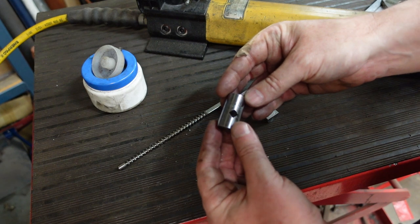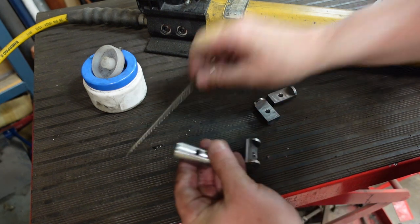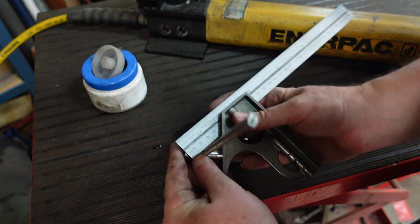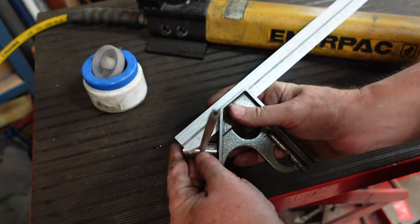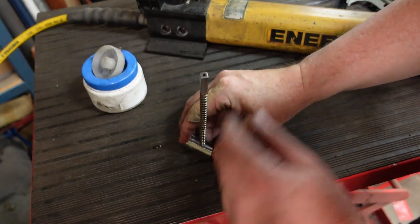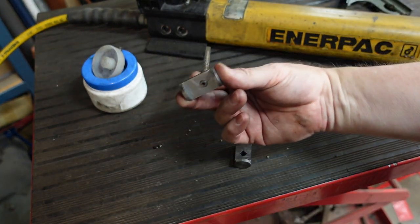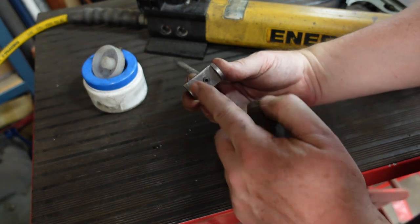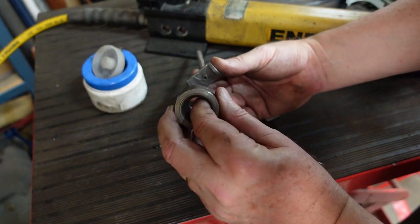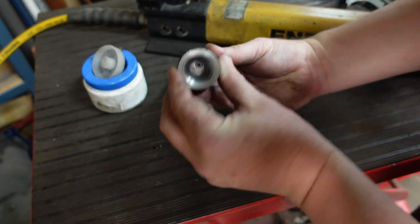I've just broached the first square hole. To line that up was actually quite simple — I just put the broach in the pilot hole and then, using my combination square lined up with one of the flats on the side here so that it was at 45 degrees, then broached away. These ones are a little tricky because they've got flats on both sides, but I found a piece of material that fits quite nicely there.